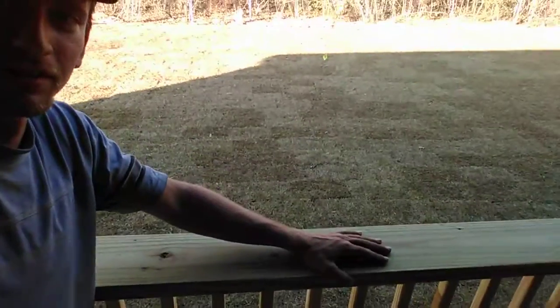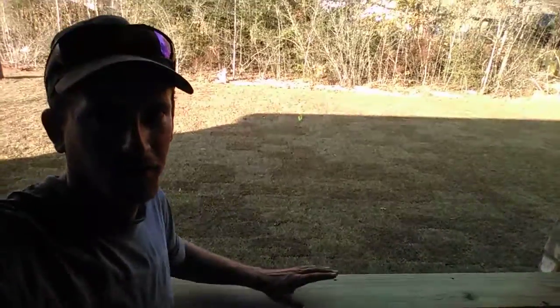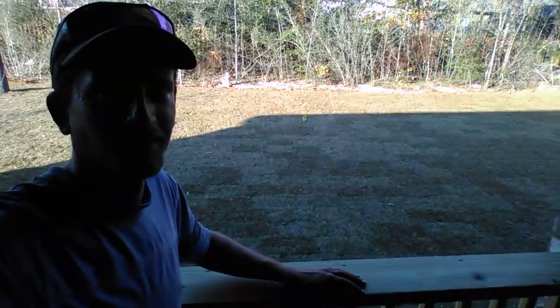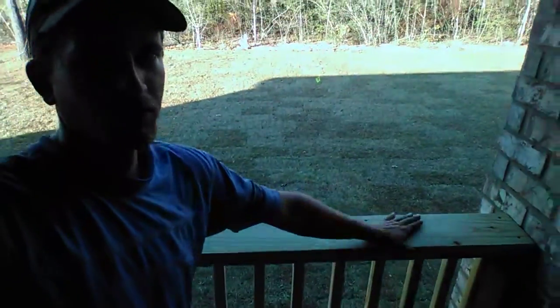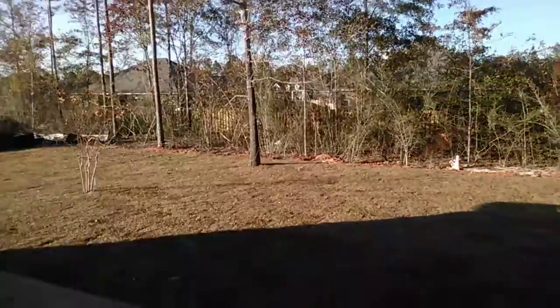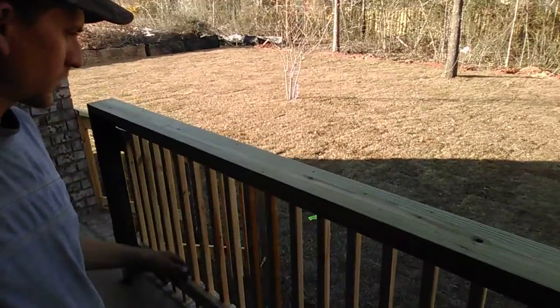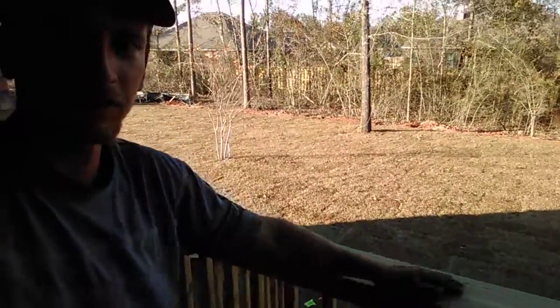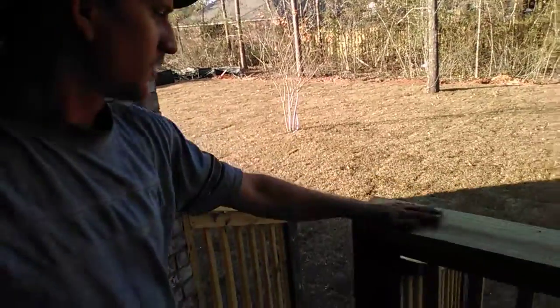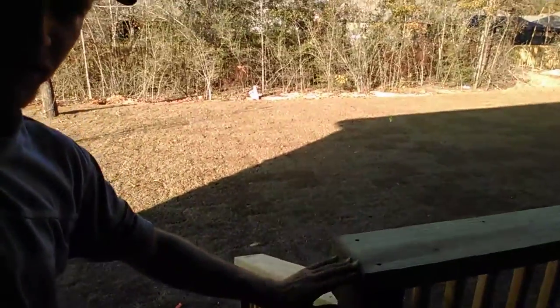Just like all our handrails, we come back across with some really coarse sandpaper. I actually use drywall sanding sheets because they don't disintegrate like other sandpaper does on this new lumber. But everything's nice and smooth — you can run your hands all the way down it and not be catching splinters or ugly unpleasant spots on your hand.